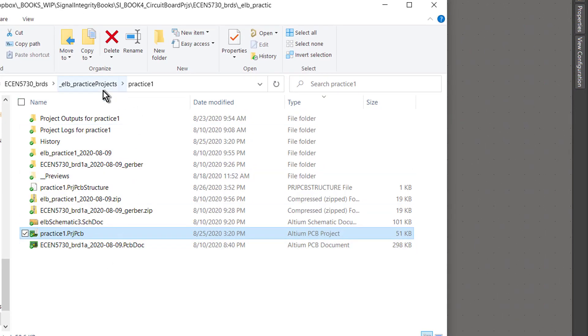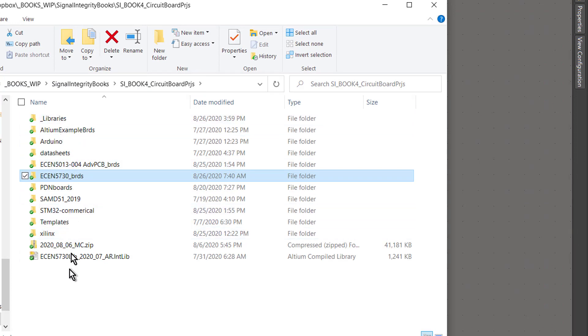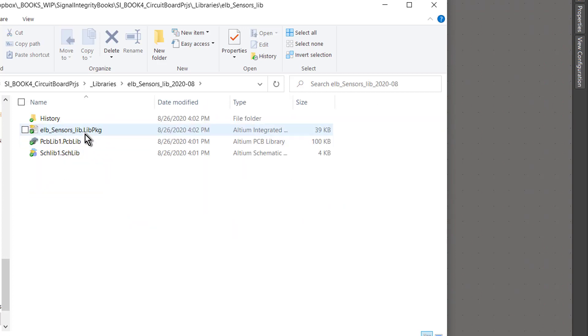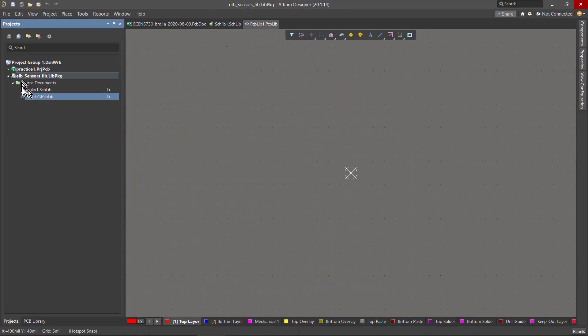Let's take a look at that structure. Here are all of my circuit board files, and here's my library folder. In it is that new folder I created — that's going to hold my library elements associated with the sensor. Here's the library package: the PCB part for footprints and the schematic part for symbols. I've got the right file structure. This is global, and from this I can add components, compile it, and make it into an integrated library usable for any circuit board project. If I give a circuit board project to somebody, I want to give them that integrated library too so they can build and edit the schematic and layout.